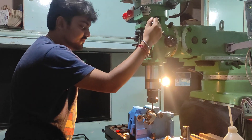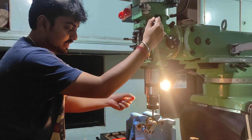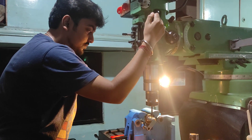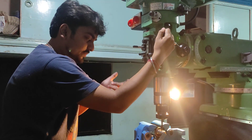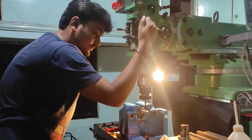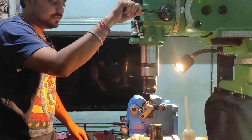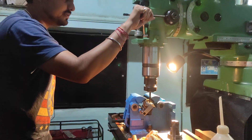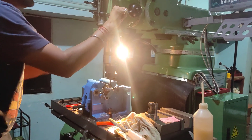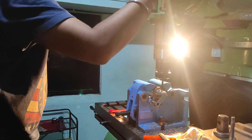While drilling, we also have to lift the drill up periodically because the chips get inserted into the job. So we lift up and then drill again — this way the job gets a fine cut. It's lift up, then pull down. This process depends on the job, because for various jobs we have to adjust the axes using the DRO. And slowly we also have to apply the coolant over the job.